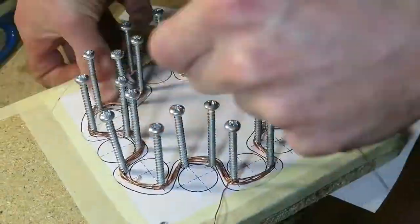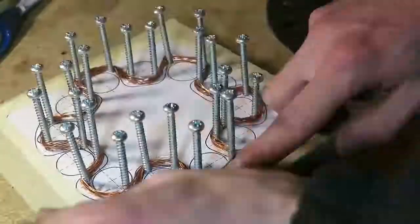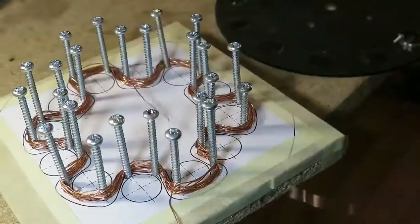This winding process is quite labor intensive, but instead of doing this you can make a ring-shaped coil and then press it into shape. This simplifies the process to such an extent that you can make say 10 coils for a 1kW motor in 1 hour.